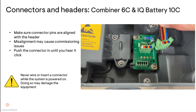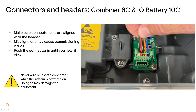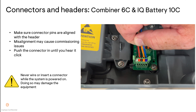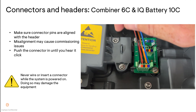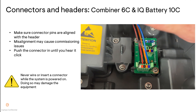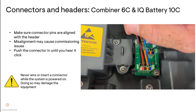I'm standing in front of the Battery 10C and I've got the control cable connector in my hand. When we go to connect it into the header, we want to make sure that it is aligned properly — we don't want it off center. Push down firmly and listen for those clicks. Once you hear those clicks, do a slight tug test to make sure it's secure. If it's not secure, you may have provisioning issues where the battery will not get detected by the gateway during your commissioning steps.